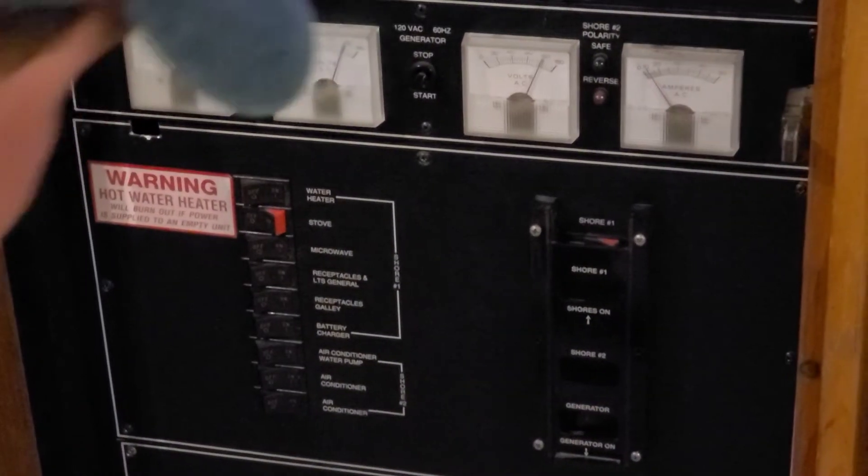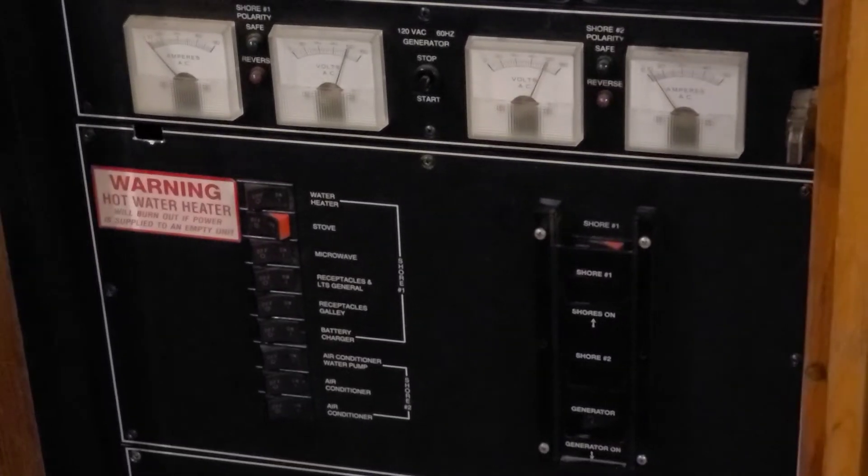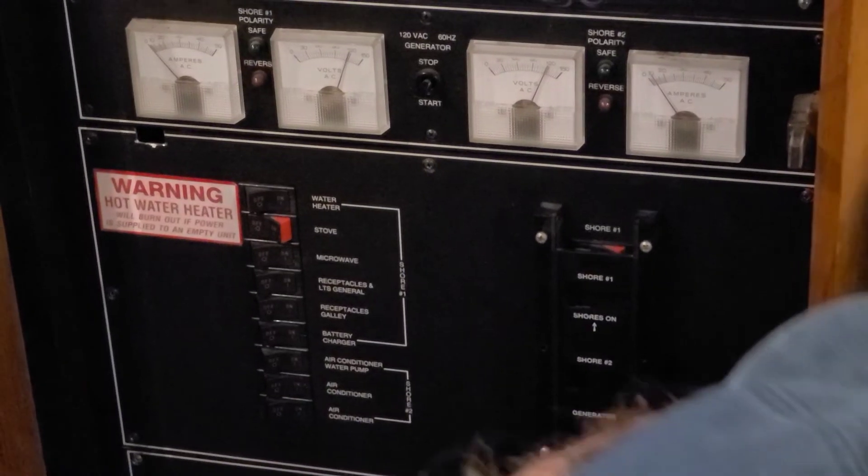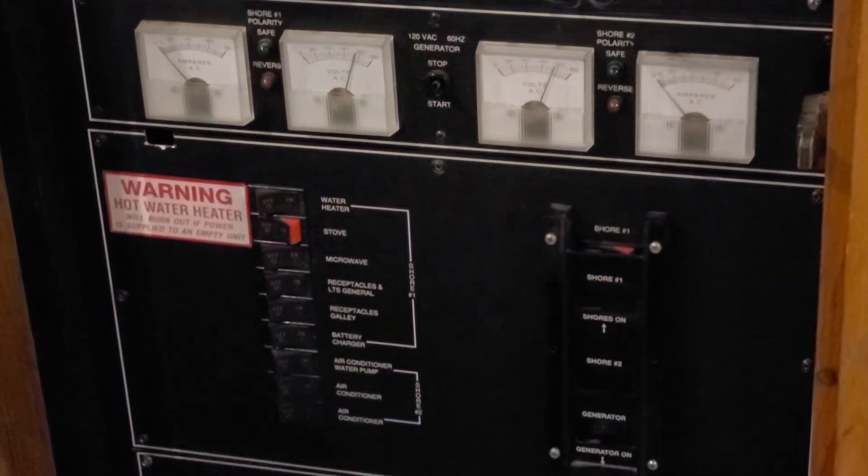Let me put the cover on. That's a little better. You can see it's got pretty steady voltage. Now there's a load on it too. If I kick the AC off again — it's still staying pretty close. It's still very, very even, which is much better. I really like that. I'm very happy with it.